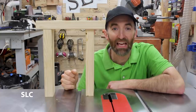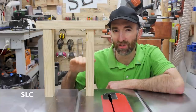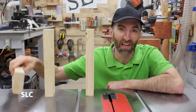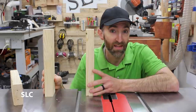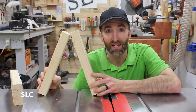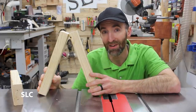So let's get started. Now if you look at a lot of patio chairs, a lot of them use the square setup — the legs go almost straight up and down, the chair is almost flat across the top. Of course there's some variations to that, like the Adirondack chair, but I think that's more of a lounge than it is a chair. So I'm going to use a very similar concept that I picked up from the sawhorses and build the legs at a triangle. I think this will look really neat, and because we know it's a real strong setup in sawhorses, this should also be able to handle a lot of weight and abuse.